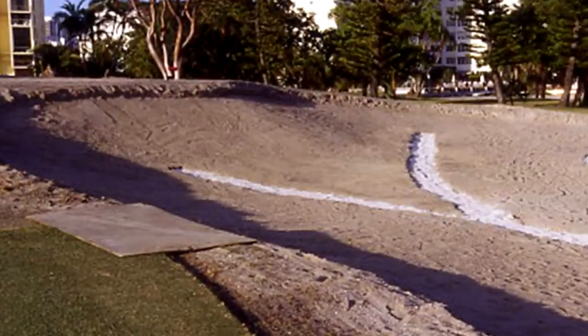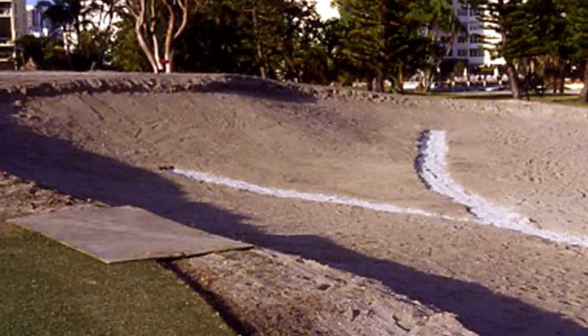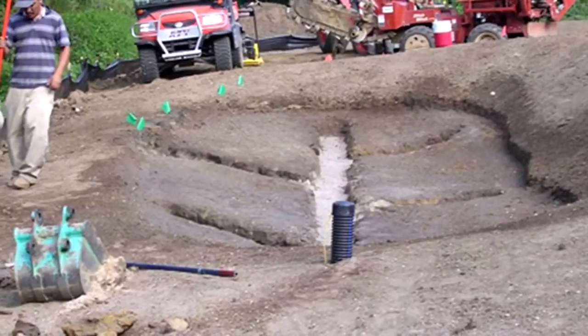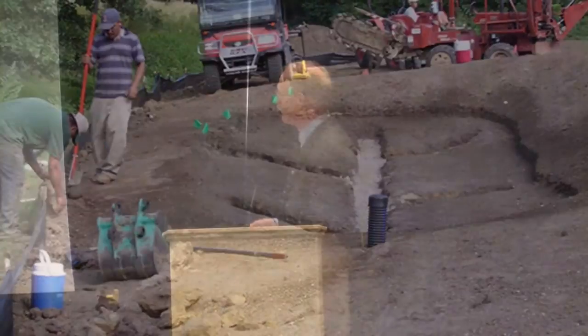In Florida, in Indian Creek, this is a bunker project done in the mid-90s. This is not enough drainage installed. There ought to be more. We had to come back and rethink the thing, and later on, more drainage was added onto this in a subsequent project. In Florida, they rebuild everything about every 10 years. Everything changes down there all the time, and the weather is so severe at times, things don't stay around like they do up here. So that's not quite where it should be. But even a small bunker, back on that liquid soil site, you've got what looks like enough drainage for a little bunker. I would say that's enough drainage, but if you're going to miss, miss high.